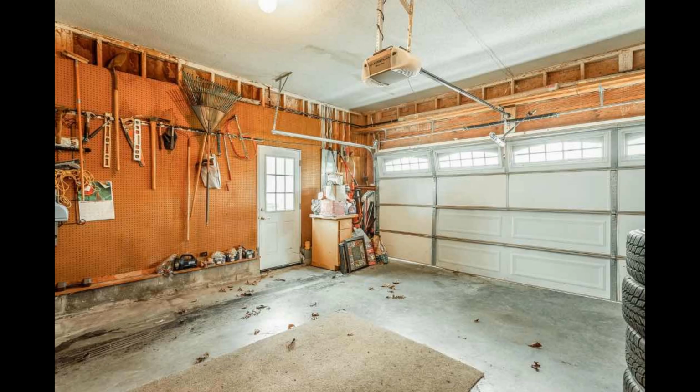So I can't say I'm 100% sure what's going on here, but it's a pan door, obviously, big surprise, and you can see pretty much the entire center stile on every panel has pulled away from the door somehow. You can also see the arm, or the trolley for the operator, came off the rail, which is pretty typical of the older square rails. And that's just kind of hanging there. It also looks like the door doesn't have any top fixtures on it, at least on the left side. So I'm not really quite sure what happened here.